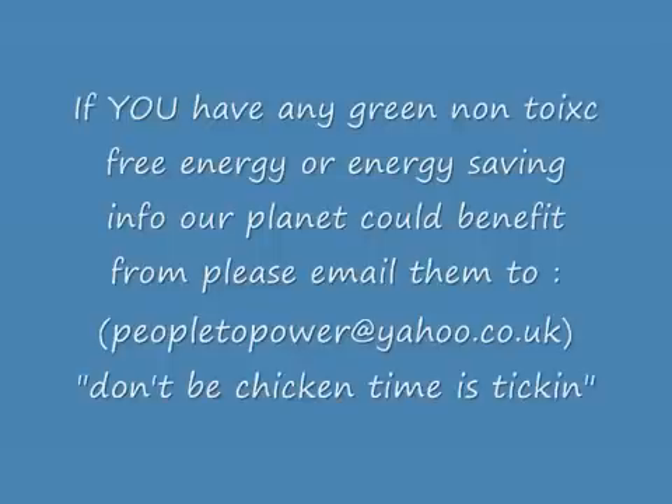When the HHO gas burns, the only emissions and vapours are water, so it burns clean, meaning your exhaust fumes burn cleaner and reduce your carbon emissions. This HHO device is quick, easy and cheap to make and should pay for itself over a relatively short period of time. Most gas-converted vehicles store large amounts of gas in pressurised cylinders, but this HHO device creates the gas from water on demand within a vacuum environment created by the air inlet manifold, meaning only minimal amounts of gas are present in the vehicle at any one time.